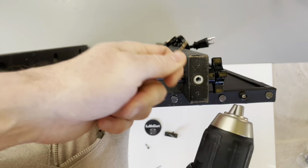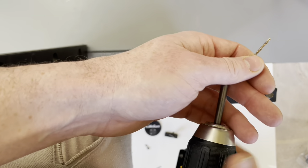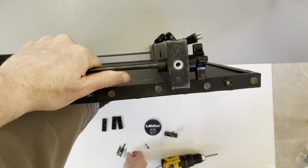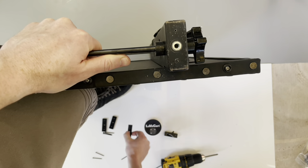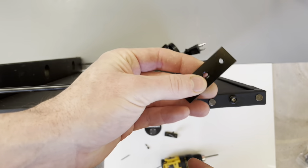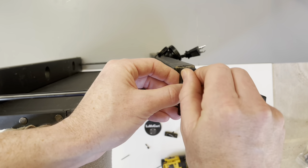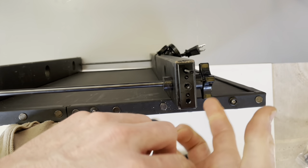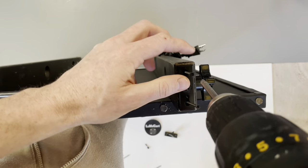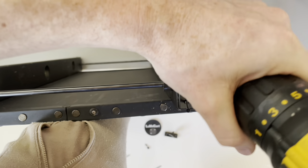Switch to a standard Phillips head driver — the heads are pretty small on these fasteners, so go slow. Make sure there's a beveled side: there are chamfers on this block and a flat side, but there's no up and down, so you can go either direction. Load in the fastener, find your pilot hole, and start it by hand so it's in the right place. Then drive them in, but go to low speed on your drill. If you have a torque setting, bring it down to about five.